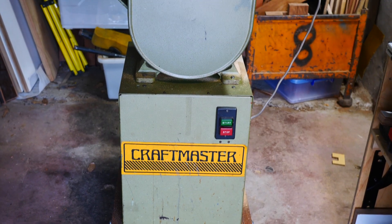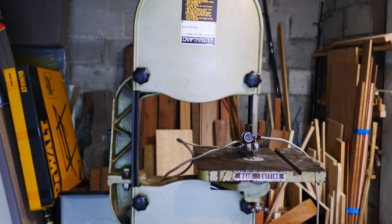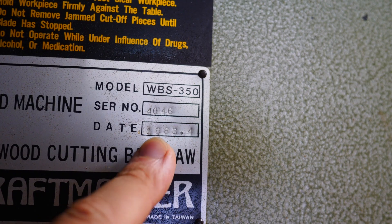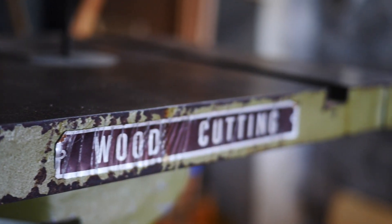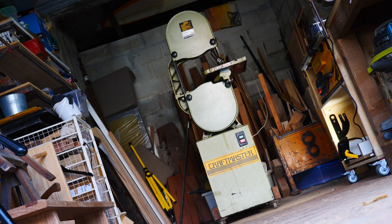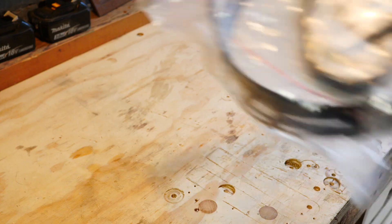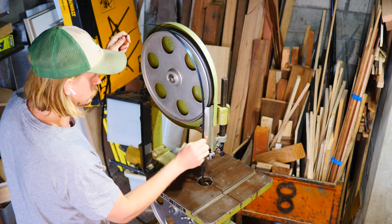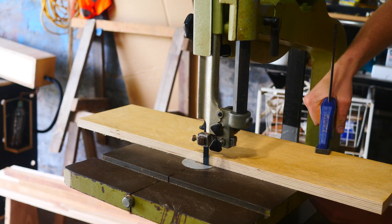Now just like my mate, not an engineer, I too have a new tool in the workshop. Meet Tilly, this beaut of a bandsaw from 1983. Named after my dead childhood dog because I dreamed about her the night before I bought it. Tilly cost me less than a slab of craft beer and a succulent Chinese meal and included a few new blades — it's a bloody bargain. I swapped the blade out for a brand new six tooth ripping blade and clamped the fence so I could cut three millimetre strips.